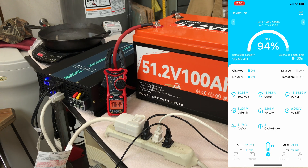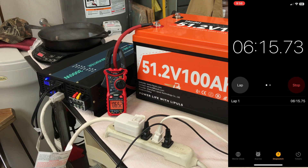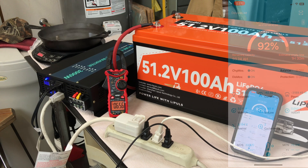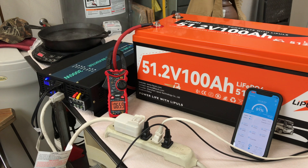We're now at 64.8 amps, 3,134 watts — that's over the rated limit of the inverter. The battery is holding at 51.01 volts. At over seven minutes in, it's just chugging away with no issues whatsoever. The app shows 62 amps and over 3,180 watts. It runs so much cooler than a 12 volt system since it's four times the voltage. I had a lot of fun doing this review. Links in the description for more info, and check out the next video on screen.